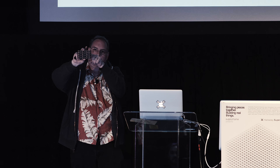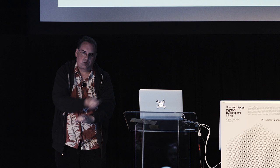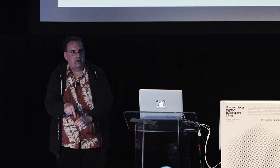And that way, your assembler, remember, think of his process. He picks a board up, he puts it on the table, he uses a template to squeegee the solder paste onto it, he puts it down, and then the robot puts all the parts on it. That's the part that he can do very cheaply, because the more often the robot is working, the less it's going to cost you, because he can get done faster and time is money.